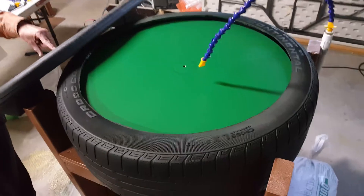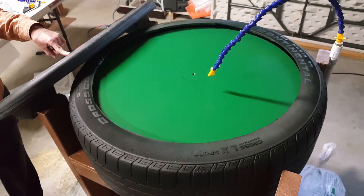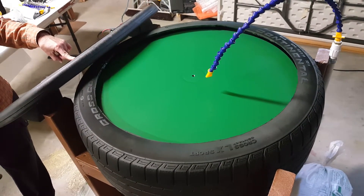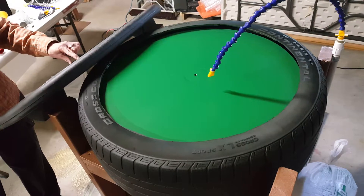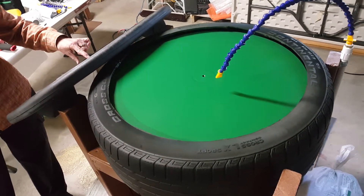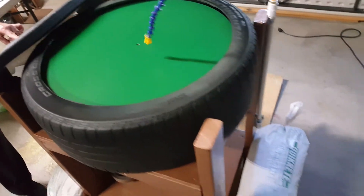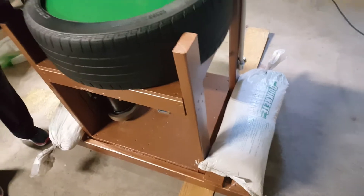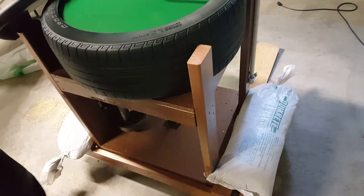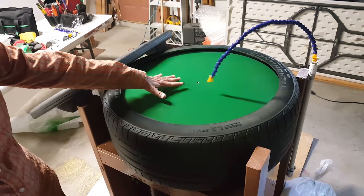So that's at 400 RPM. We're going to go through a shake zone — up to 1100. You can see the water spout; when it starts to shake you'll see the water spout starting to vibrate. But for the amount of mass that's rotating here, that ain't too bad. You can see on the sides I put a shelf on each side and I've got tube sand to add ballast to the lower side of the machine.